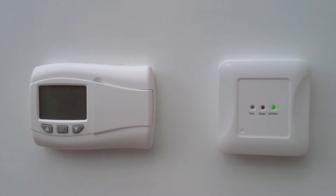For the purposes of this demonstration the transmitter is wall mounted, but of course it could be desktop mounted and you can literally pick it up in your hand to program it. Although be aware, if you are holding the unit it will sense your body heat and that will change its measured temperature, which could affect the switching output.